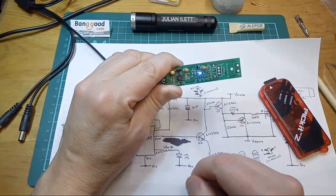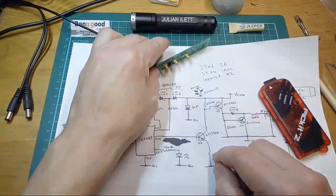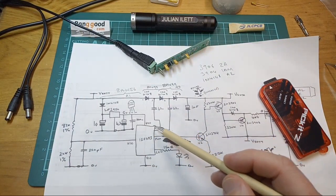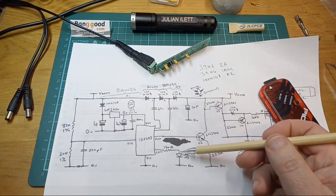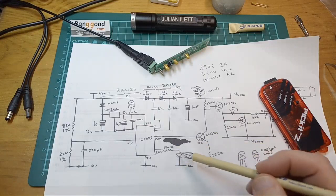Yes, you wouldn't be able to use it many times, but that's the direction I'm thinking of going. The only problem is this chip only has 8 pins. The 5 pins that you need to use for programming are also used for, I think one of them's the LED. So you've got a 150 ohm load on there, but with a 3 whatever volts offset. It might work. It might program with that LED in place.